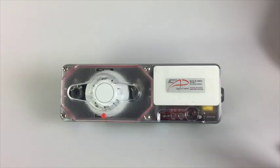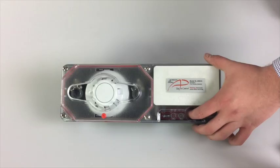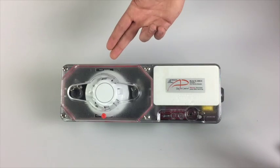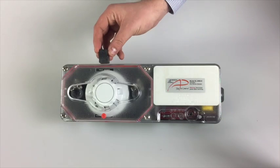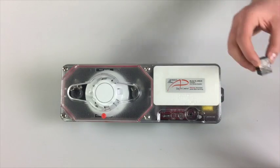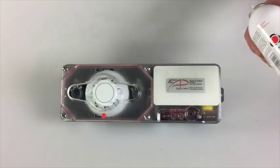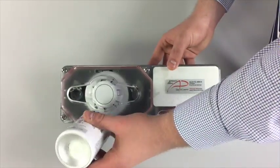The ease of testing the SL2000 also follows the Air Products and Controls contractor-friendly philosophy. The reset switch located on the detector is also a test switch, so testing can be done at each unit. You can perform a magnet test without cover removal — the location to place the magnet is clearly marked on the cover, and a magnet is included in the install kit as well. Smoke testing can also be performed without removing the cover. With our TG2000 test can, put the nozzle into the test port valve and give a quick one-second squirt to smoke test the head.